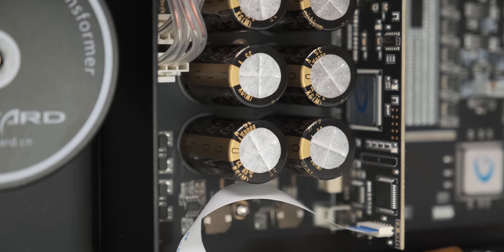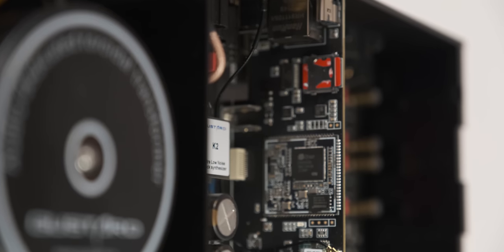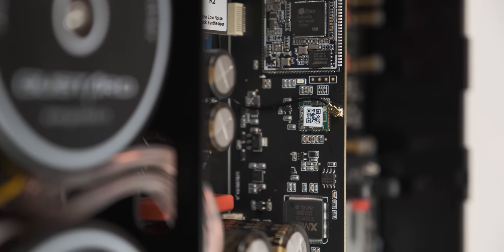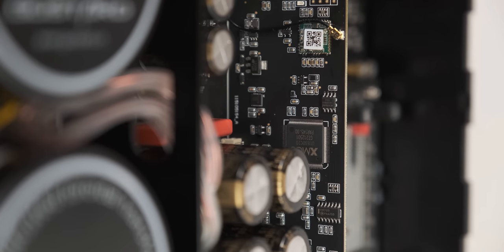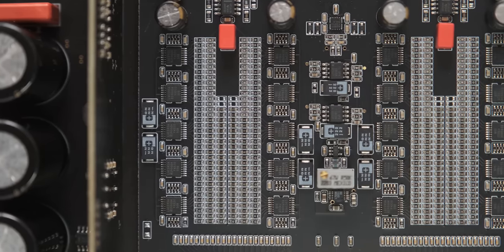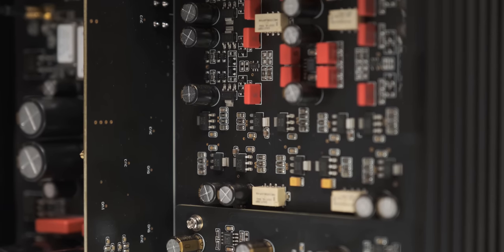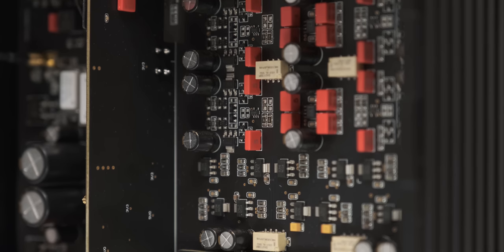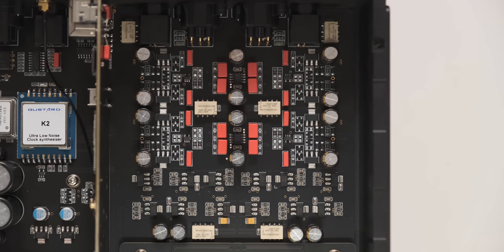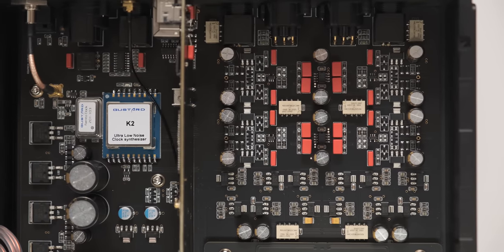The board in the middle also houses an overkill power filtering stage using Nichicon Gold Tune capacitors specifically designed for audio applications. A vertical daughter board between the second and third rooms houses the streamer/renderer, digital receiver, Bluetooth chipset, clock management, and a second-order PLL — the nicest clocking and data management board I've seen at this price point. The third room houses beautiful, perfectly arranged R2R resistor ladders helped by an FPGA, plus a fully discrete output stage consisting of hundreds of discrete devices. Everything you see is over the top with no compromises.